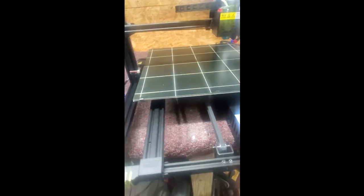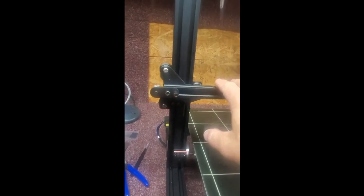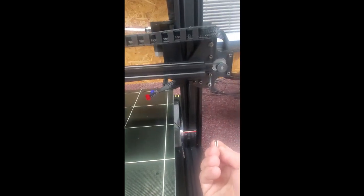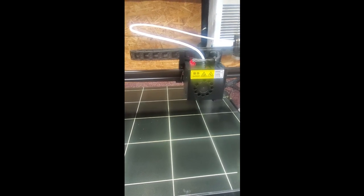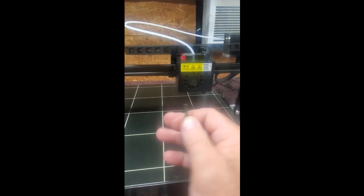Something that may not be clear to everybody is that if you have the control box with the power switch on this side, then you want the box facing forward towards you and then put the gantry frame together. What I did was set it on top right where the hole was, then put one of these screws in on this side and then one on this side to make sure they're lined up. Now you should be able to put the other two in. You don't want to tighten them up until after you get them all to catch, and you want them to screw in easily with your fingers. You don't want to have to torque them with a tool yet, because that may mean you're cross-threading. So back it out, unscrew it a few times, and then try and gently screw it in. You should be able to turn it quite a few times with your fingers before you have to use a tool — otherwise you may be screwing something up. Stop, back up, and regroup.